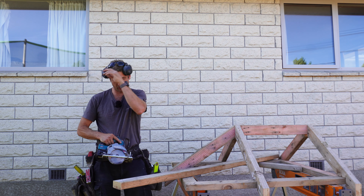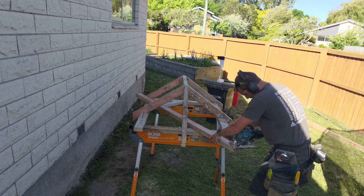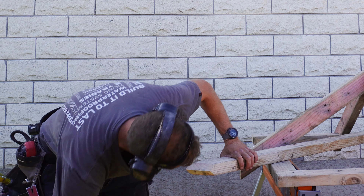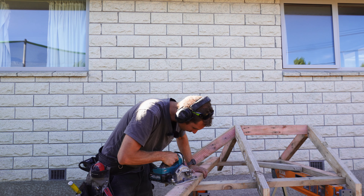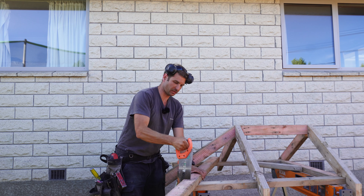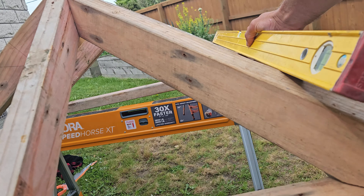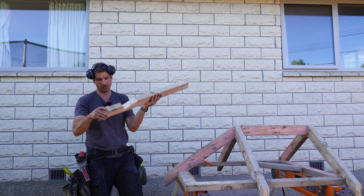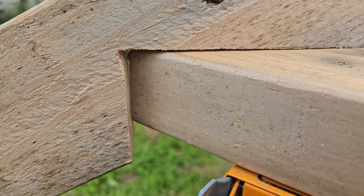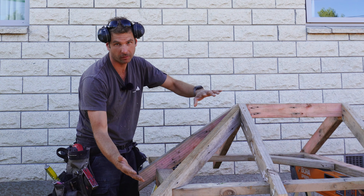For the top we actually want a 45 degree angle both ways so that it slots into the corner. Cutting bird's mouths — a bigger saw will save you a little bit of effort here. I'm just using a small saw because it doesn't cut through into the second layer, or barely does. The only thing missing is the overhang, which is easy enough. You could make the seat cut 45 as well to sit on there nicely, but there's pretty much no load on that tail so it doesn't matter — it's still being supported. You would have bigger rafters in a real build.